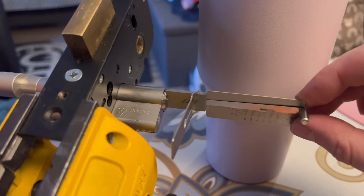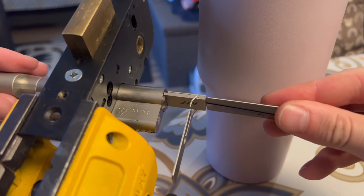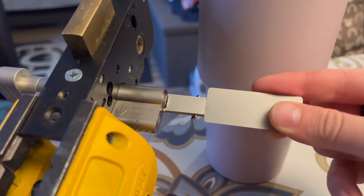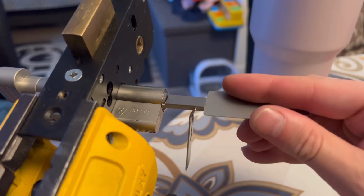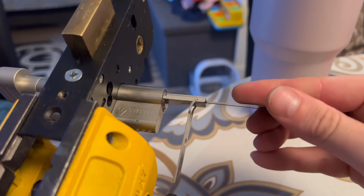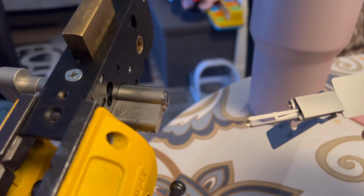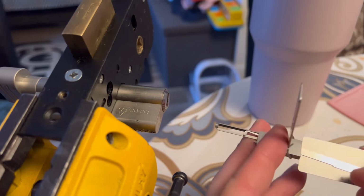So we're turned. You might want to look at the back of the lock and see that it's not going round. Now the resting position here is where the key would have left it, horizontal thumb turn on a Winkhaus. And yeah, you can see we're not getting that picked up, unfortunately. I believe with the older cylinders, it does pick it up, but the new ones, and mostly what we're going to come across is this one, and it doesn't pick it up. And that's because the blade on the pick is too short, unfortunately. By a hair, by about that much. It's just a bit too short.